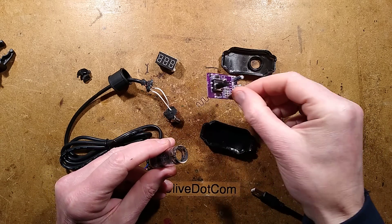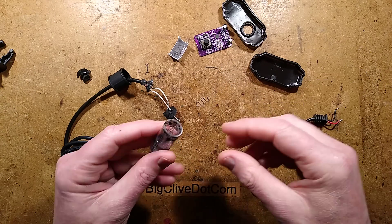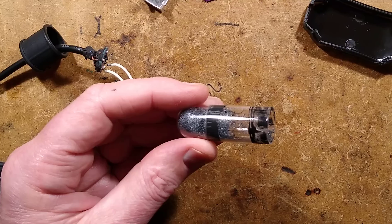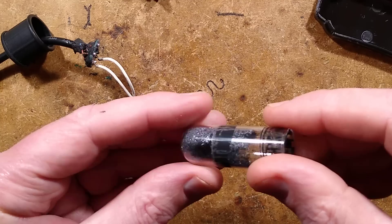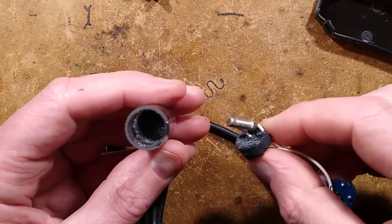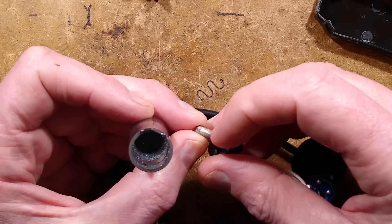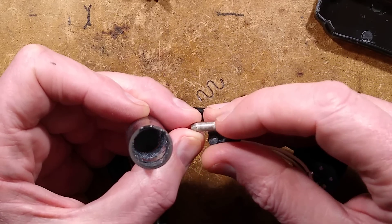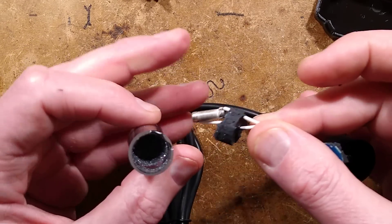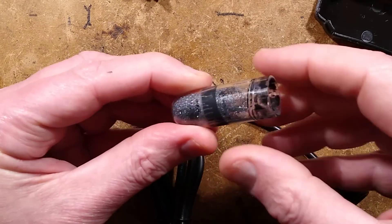The heater has been extracted, as has the circuit board, and components taken off it — it's been reverse engineered. This case just basically unclips; it's got a clip in each corner. This glass tube has black sand inside — it's not conductive, it's got a metallic granular look but is just a sort of fine sand. To make this they've used a ceramic core with an end cap in each end, then wire-wound — it is a wire-wound resistor without a cover. They've spot welded the resistance wire onto each end cap, and the wires are just soldered onto that. They've basically plunged that into the sand and poured in some silicone, which was very squishy. I had to physically slice all the way around to get it out of the glass.